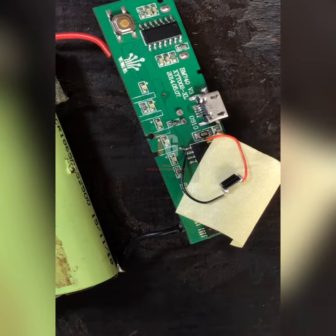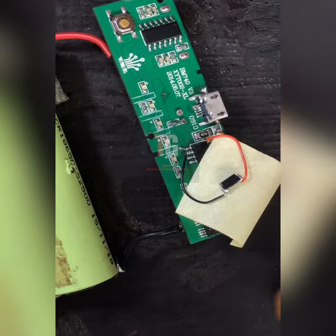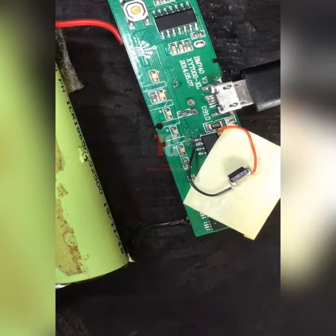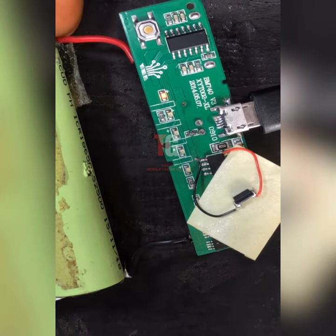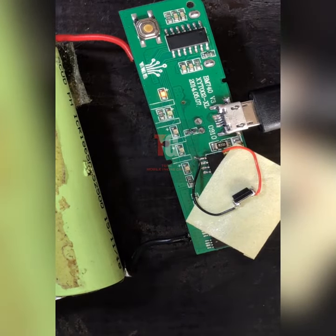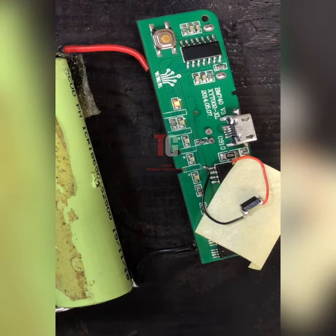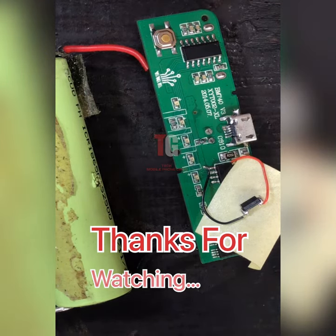Let's try it again to be sure. Let me plug it in — it's charging. Let me unplug my charger again and let's see whether it's going to stop. It stopped. The reason why it's taking a few seconds to go off is because the charging IC is still receiving some little current before the diode stops the current going to the charging IC.